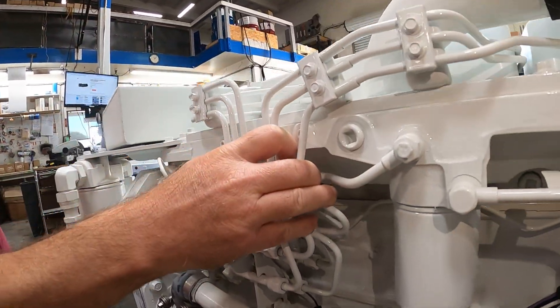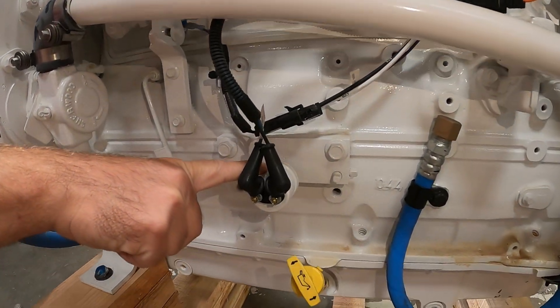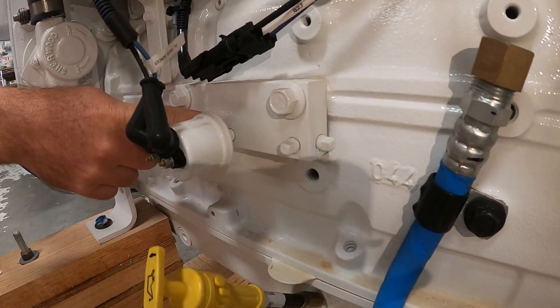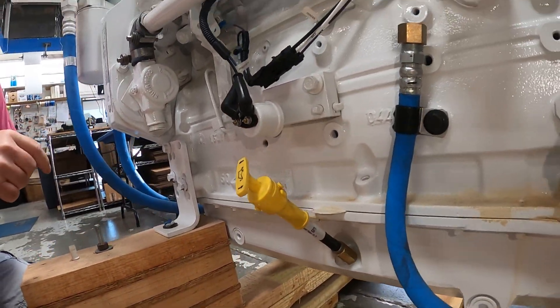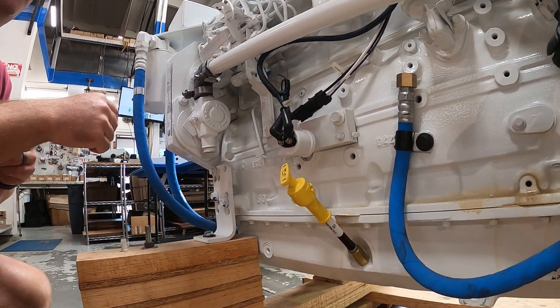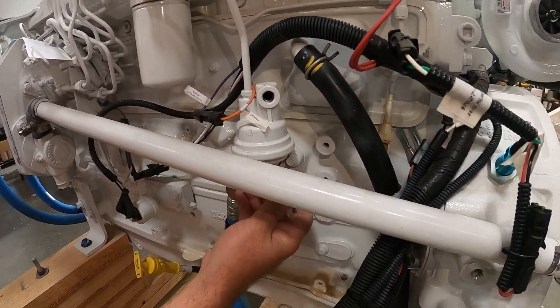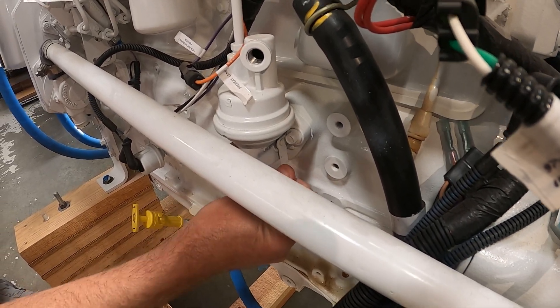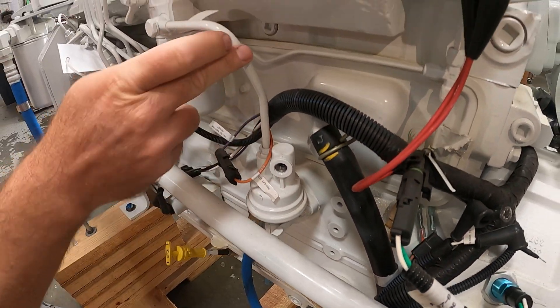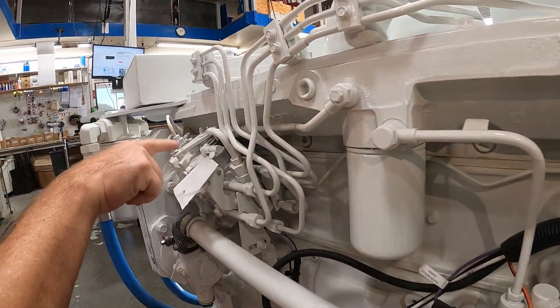Here are your fuel supply lines, or your injection lines down here. Oil pressure sending unit — that's an eighth inch pipe connection into that manifold. On the supply side, we have a standard manual lift pump with a quarter inch pipe input, and down here to prime it, it's a manual priming system, pretty straightforward like an old car. That fuel line comes into here to the on-engine fuel filter, and that feeds fuel into the injection pump.